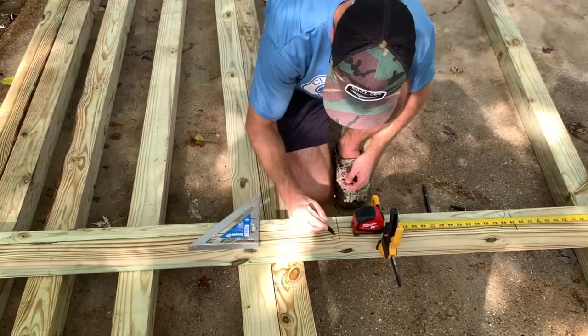The number of roof rafters you'll need will depend on your roof rafter spacing. I recommend between 12 and 16 inches. I was a little bit more conservative here with about 10.5 inch spacing in between my rafters, but you want to space your rafters so that the plywood you install later will have edges that land directly in the center of a roof rafter. Now, I understand that planning out your roof rafter spacing can be a bit time consuming and a pain in the butt.